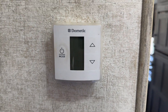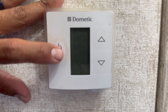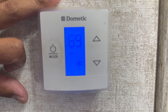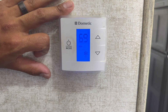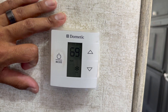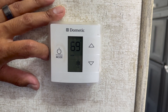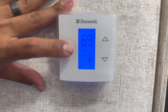The thermostat is right here. During the summer it'll be set up for AC. Come to the thermostat and turn on mode — the fan should be on high and set to cool. The AC will come on. Do not go lower than 69 or 70 degrees. If you do, the coils in the AC unit will freeze and will take about four to five hours to thaw out, leaving you without AC for that time. To turn it off, keep pressing mode until the unit cycles off.